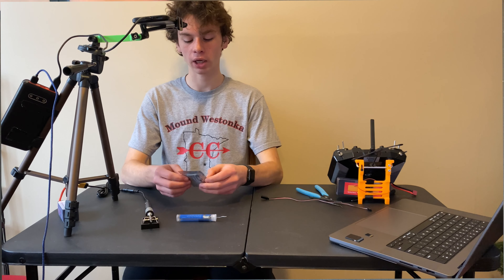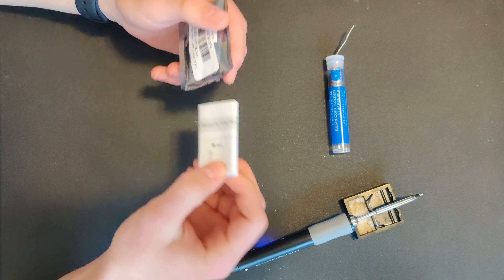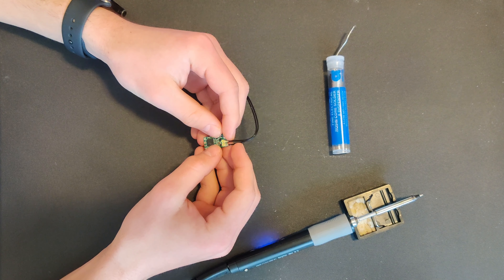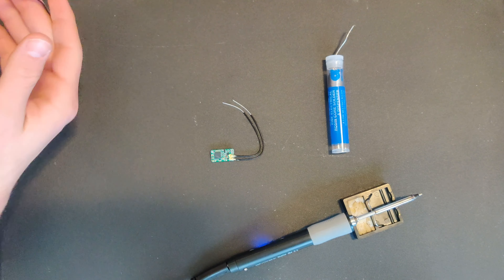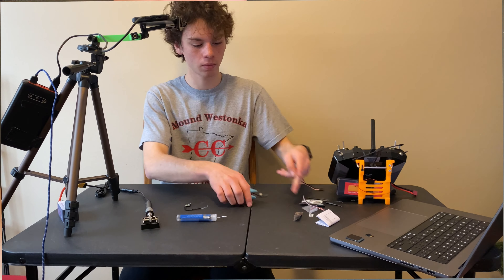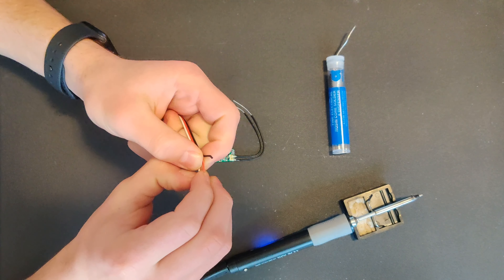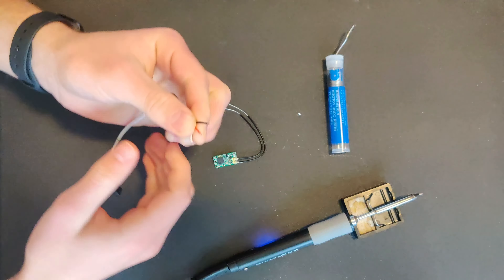To start, we will need to begin by unpackaging our XM+ and heating up our soldering iron. Now that our XM+ is unpackaged, we can start connecting the servo plug to the pads in preparation for connecting it to the controller to flash it. To prepare our servo plug, I'm going to chop off the wire here, separate each wire so we have a little bit of room to work with, then strip each wire to expose the metal so that we can solder it. And now it is ready to solder.